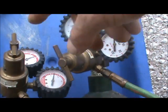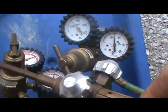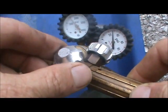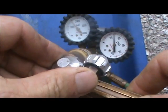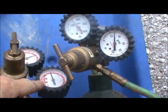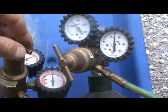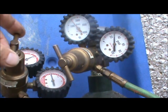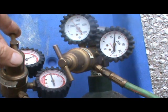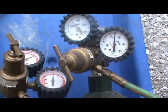The first thing you're going to want to do is turn on your acetylene without any flame — a quarter turn — and then the gauge will roll down a little bit once you have some of the acetylene coming out. Adjust your regulator to increase or decrease the output pressure of the torch to 5 psi on the acetylene, then turn it off. You can see how that gauge goes back up.